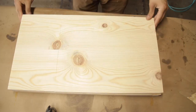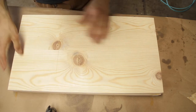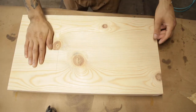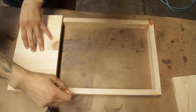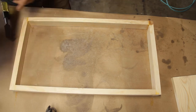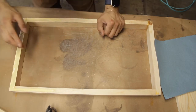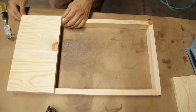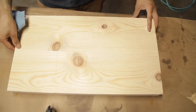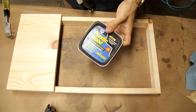I'm making sure everything sits nice and flush, then I'll remove the adjustable part, hold the stationary part in place, and strike a line with a chisel or marking knife so I know where to glue. Then just go ahead and glue down that marked section and fasten it with some brad nails or screws if you want to cover it up. I'm just adding glue and brad nails and I'll fill the holes with wood filler.